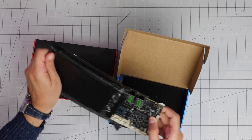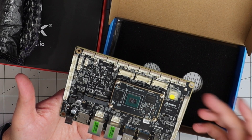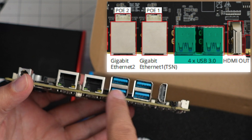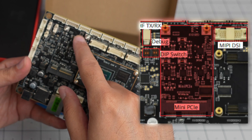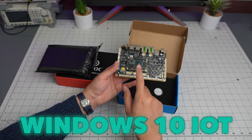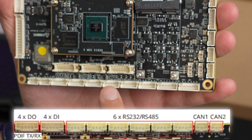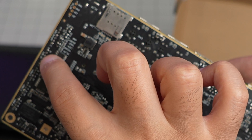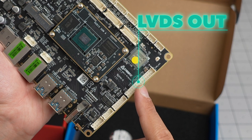They pre-installed it for me, which I appreciate. This is a Debix SOM-A and as you can see it is industrial, so it has a lot of connections. You have GPIO, COM ports, four USB3 ports, two gigabit Ethernet. There is a mini PCIe slot, an SD card in the back. It can also install Windows 10 IoT. There are some proprietary DSI and CSI connections, plus LED, I2C, TP, USB headers, and a monitor LCD connection.